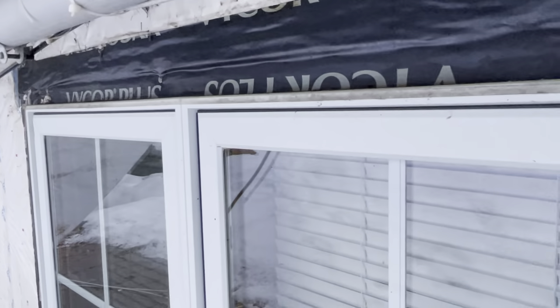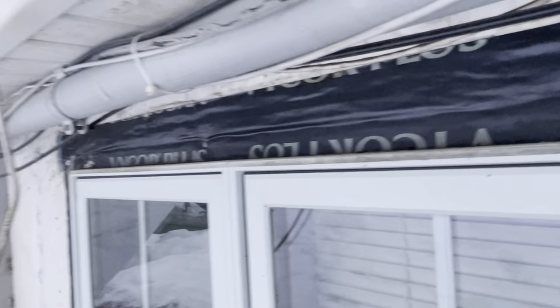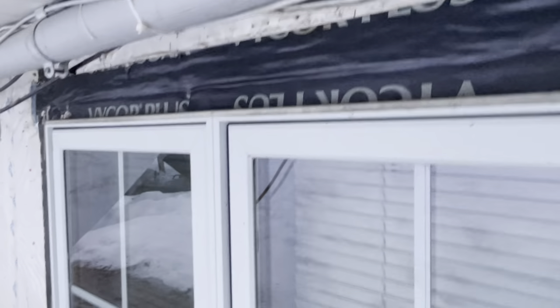Another big thing: on the top of all windows there's a drip cap that you have to have on top of every window, door, or opening - that includes garage doors or any piece of horizontal trim. This happens to be a plastic piece that came with the window. A lot of times what we'll do is bend some aluminum trim coil to fit on top of all the openings or trim. It's called Z-flashing - it extends down over the top of the window like a cap and then runs up the wall another two inches. That's meant to flash the seam. Anywhere you have a seam, whether roofing or siding, you've got to flash it, otherwise water is going to find its way in.